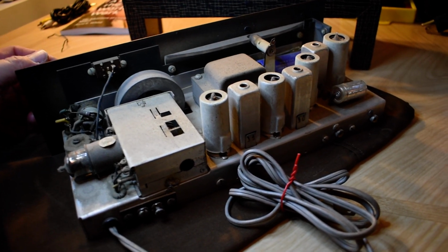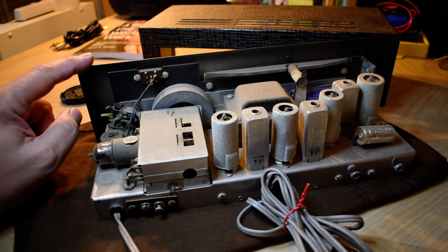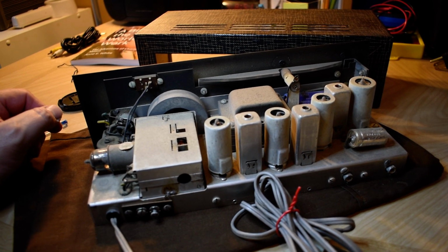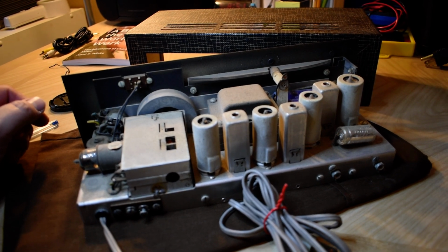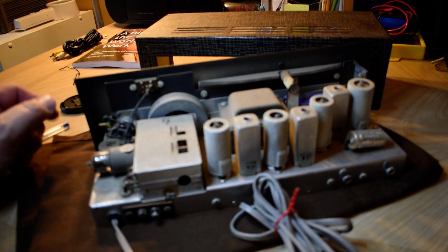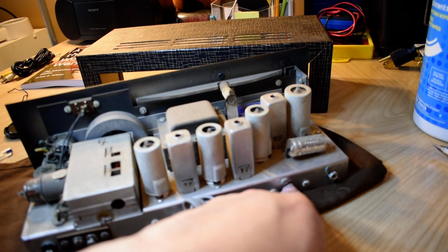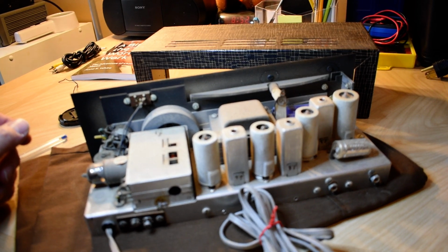Or, just for interest's sake, many, many years ago, believe it or not, I had an FM-4, and I'm talking 1983. And I found in Popular Electronics an actual diagram using, I believe it was an LM1800 multiplexer chip, and actually made just a small board that ran on a 9-volt battery, and you took it from the MPX out, and then you had stereo left and right. Don't have it anymore, but I'd be curious to make it.